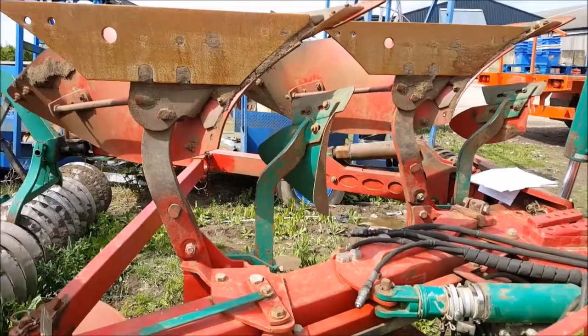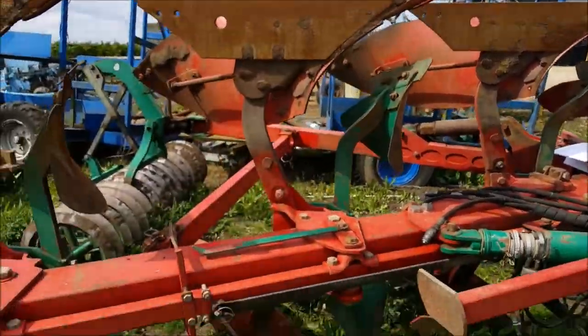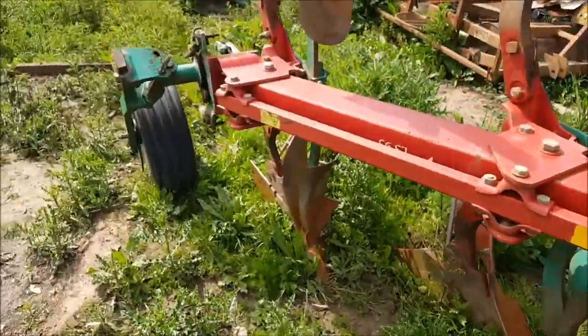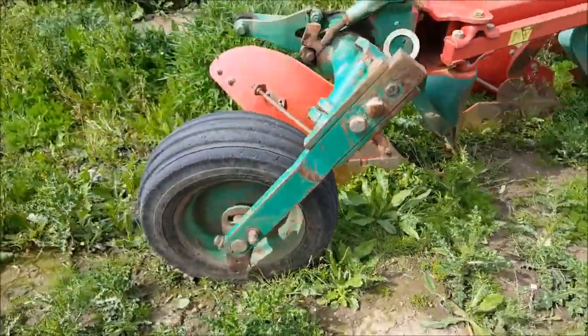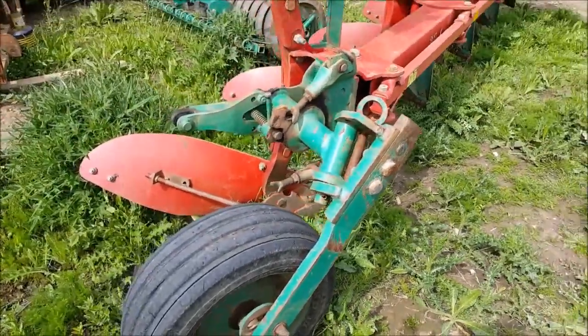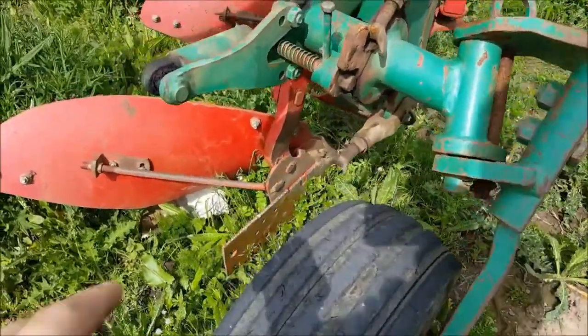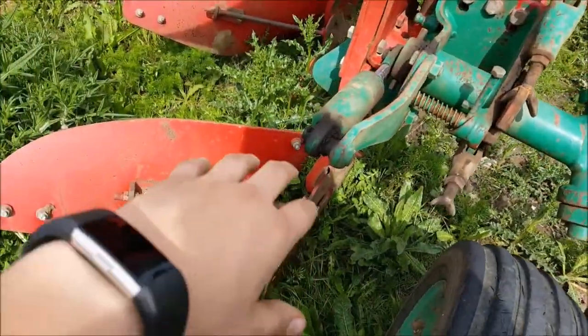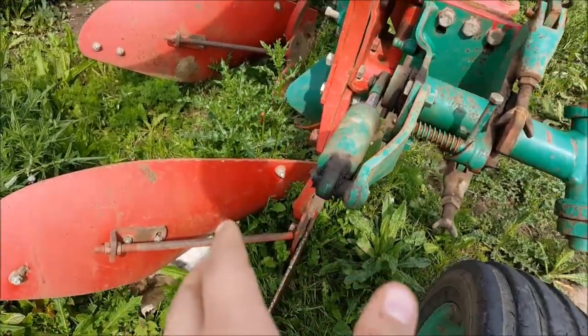The main stock is going proper deep in. The other thing you could consider a safety device is your depth wheel — that's just stopping the back end of your plow going in too deep. If you're getting too deep you'd start wearing up the leg, and soon you'd pretty much just leave the end furrow behind if that leg wore away enough.